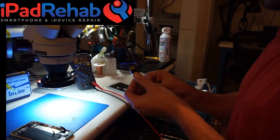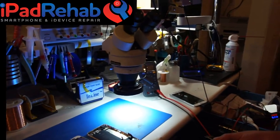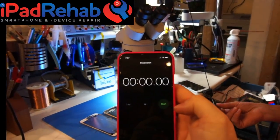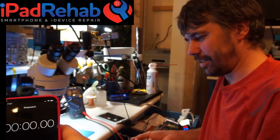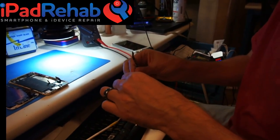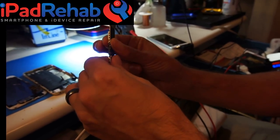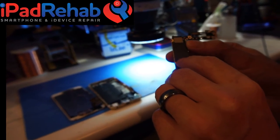So we're going to reset the timer and start it now, to give you a fair chance to find the actual culprit for the short on VCC main. Tell us what you're doing as you go — begin. I'm connecting power and just feeling around on the board for any signs of heat. It's getting warm right in this area, not super hot but pretty warm — above the NAND on the back of the board, or maybe over here. The bottom is also getting warm.